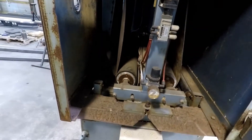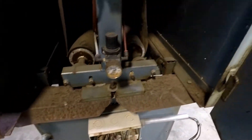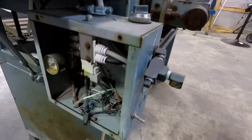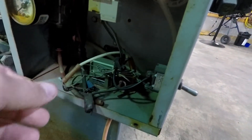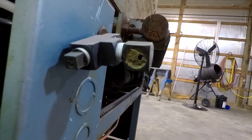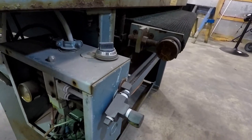It's really hard to see because it's so dark, but there's a piece of wood in there. We're definitely going to have to get that out since we're planning to use this for metal. This whole top here unbolts with four bolts - one in each corner - and we're just going to lift that off so we can repaint it. The air control over here looks like it just runs off 120 with a three-conductor cable. We'll probably knock that mud dauber nest out or just replace the fitting - the fact that it's there means this has been sitting outside probably.